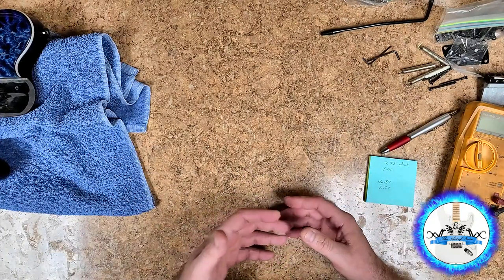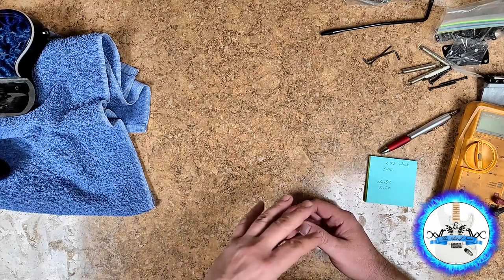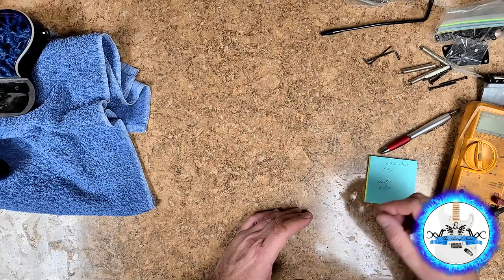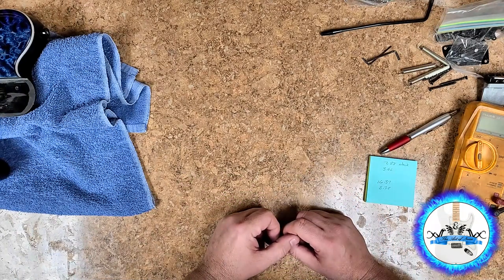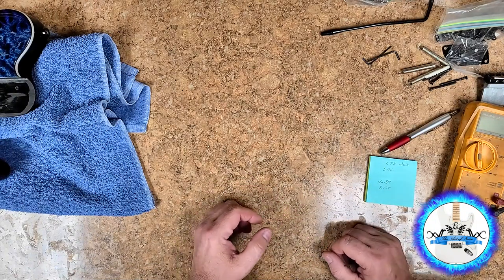I kind of want to show off the Sterling a little bit and I've got basically everything done with it besides the neck. I got to do a little bit of polishing on the neck and that's about it. Fret work has been done, level and polished. It's just the headstock — I have to do a little bit of level sanding and polish that out, then go ahead and start drilling out the holes for the tuners.